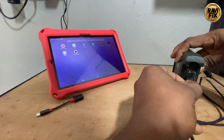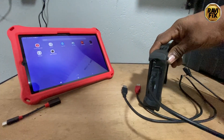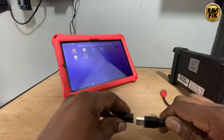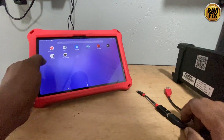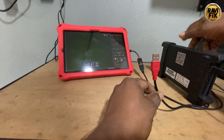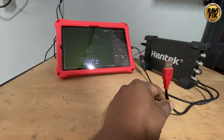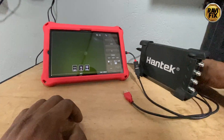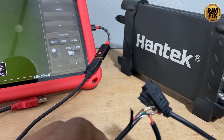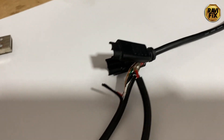Let's go to the cable modification. First of all, I connect this Y-cable to the scope and the tablet — this USB Type-B connector goes to the oscilloscope side, and this black USB Type-B connector goes to the tablet side through the OTG cable. Next we need to connect this red USB Type-A connector to a 5V charging source. But first, I'll show you the simple modification of this Y-cable that I have already made. Here you can see I have already cut and opened the cable splice which connects the red USB Type-A charging cable.